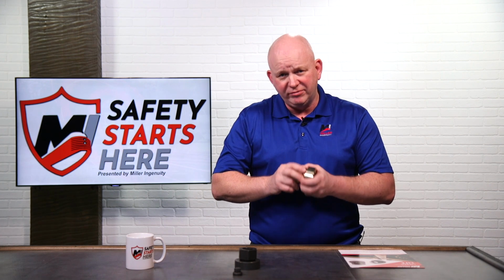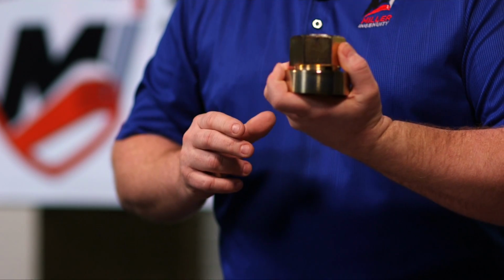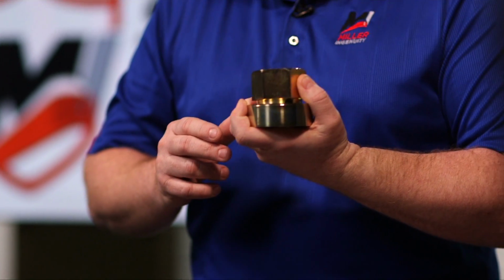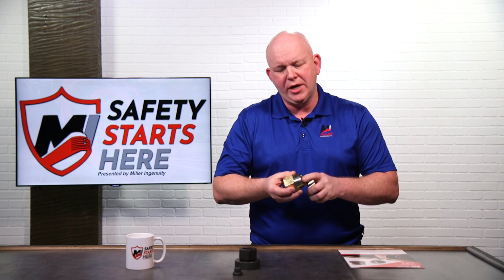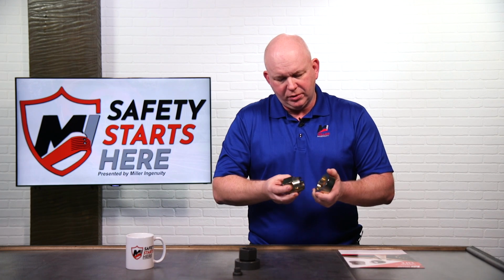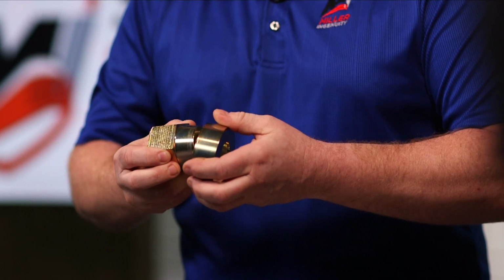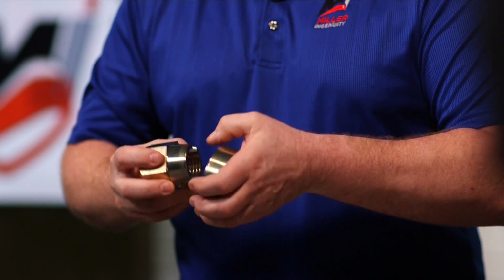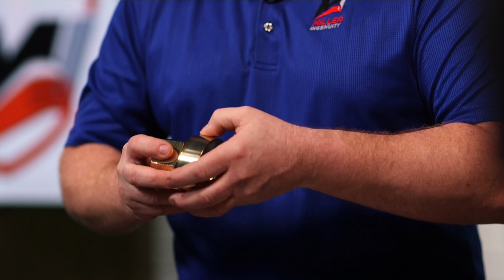You know, you have employees out there tightening up track bolts every day. And for what reason, when you could have a great product like this? So we developed a product that doesn't loosen up under vibration constraints. We solved the problem by coming up with a unique design, a two-part system, where the annulus of the nut is forced into the collar, and that creates the force, and it doesn't relax like a standard locking fastener.